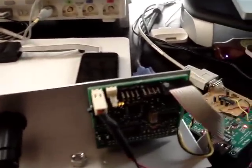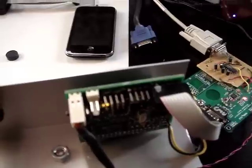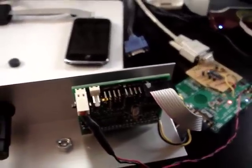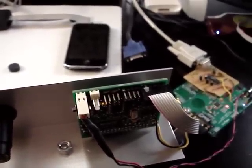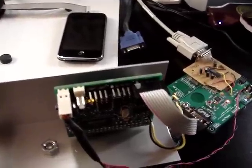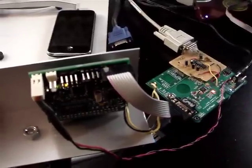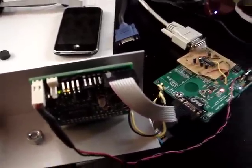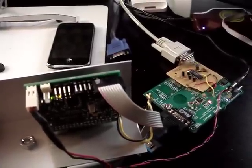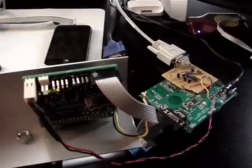The camera we're using right now — the CMU cam — has a resolution of 176 pixels across, and we're using half of that to detect from the center point to the edge of the screen. In the real unit, I'll end up with a 640x480 or maybe a 1024x768 camera module, whatever is available and low cost, and then we'll get a lot better resolution.